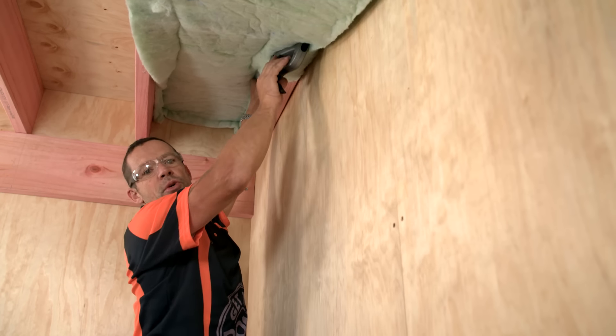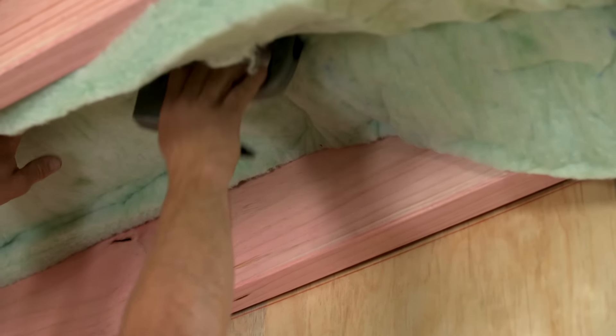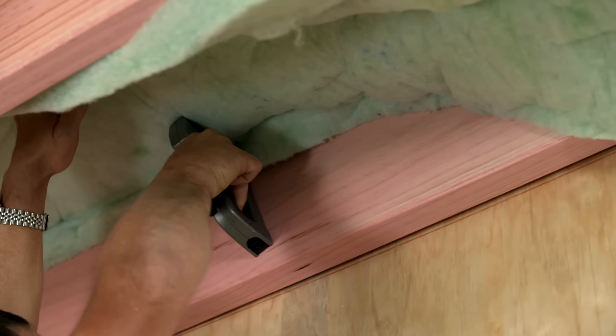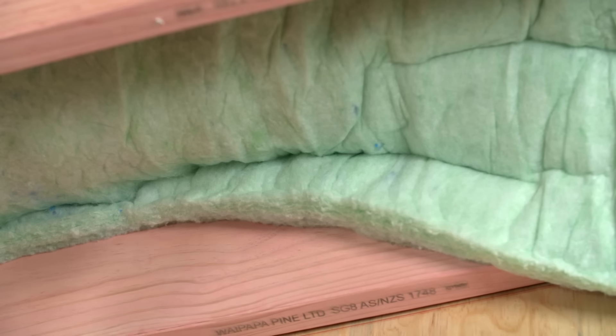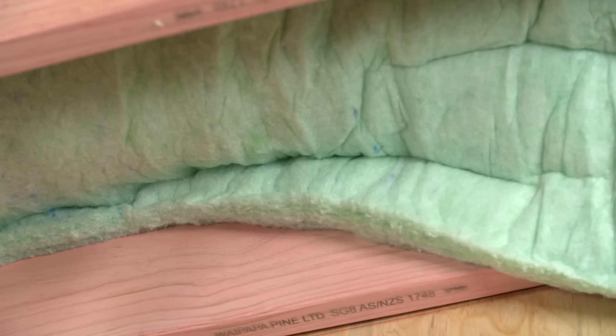After that first 200 millimetres, we want to staple approximately every 300 millimetres. When you're installing your staples, just make sure they only go into your joists 70 millimetres down from the underside of your flooring — never staple to the underside of your flooring itself.